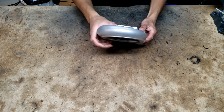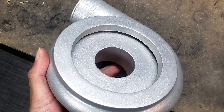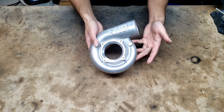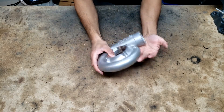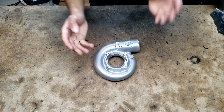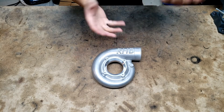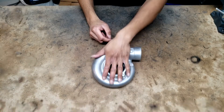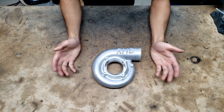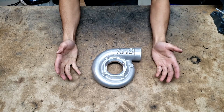This part looks so passable as cast and so normal pretty much because I exercised zero percent of the extra design freedom you get with SLM printing. This part was actually designed to be cast — everything is drafted, even the letters are drafted slightly for mold release purposes. You don't need that in 3D printing; you could have negative draft, curved outlets, non-round shapes — but again, this was just the first one.